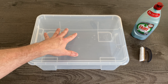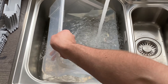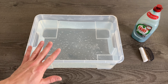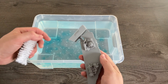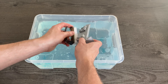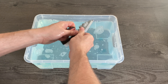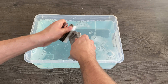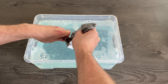I'm going to fill this with some hot water — I put the temperature on full on my hot tap and let it fill without adding any cold. Then take the detergent and give it a nice splodge. The next thing is simply to put the part in and give it a good old scrub, working all the surfaces and agitating the release agent. You can tell because as soon as you start doing this, these parts start to feel kind of slimy in the hand.